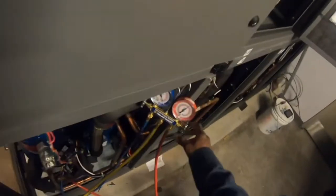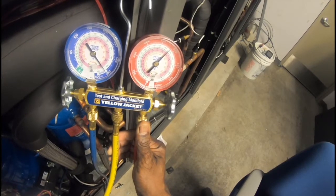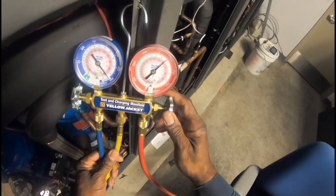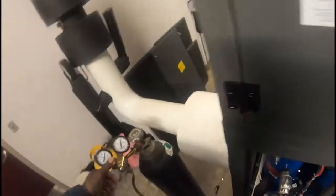Let's pump it up and let the high side rise. I'm going to let it get up to about 475 psi. The factory test pressure on the high side was 500, so I'll open it back up and pump it. That's about all I'm going to get.